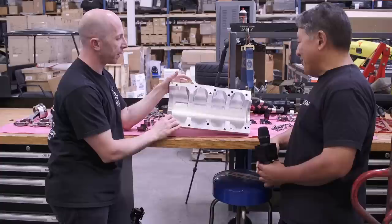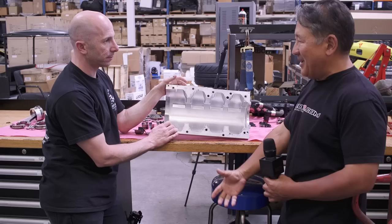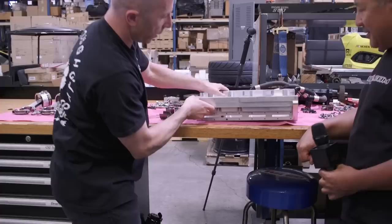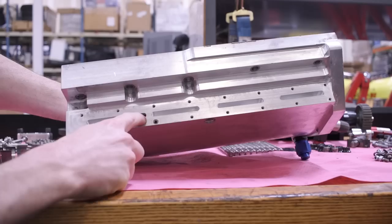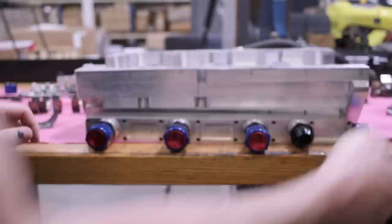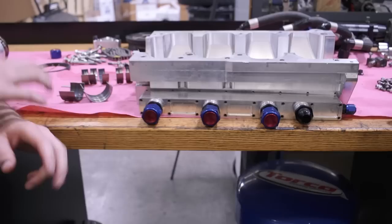The interviewer's engine runs five scavenge stages — four for the crank and one for the turbo, since the turbo is mounted really low. Steph shows the oil pan manifold assembly, which is complex in how it bolts on. It has the individual suction scavenges, a drain from the head, a connection point for the turbo drain, and a detachable section so the pan can be bolted on. They do share a couple of scavenging stages, which isn't perfect but isn't a real problem in this application.